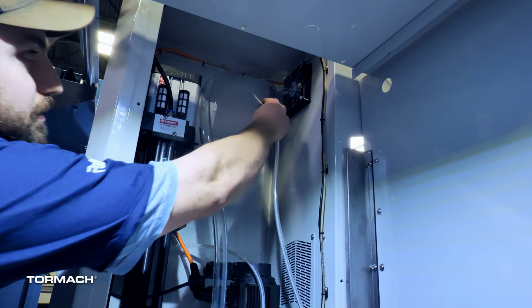Find the bulkhead fitting and remove the locking nut and one of the 2 rubber washers. Place it into the hole, pointing at the spindle at a 45-degree angle. From underneath, reinstall the washer and locking nut. Secure with a 30mm or 1 1/8 inch socket wrench.